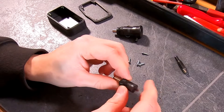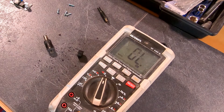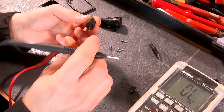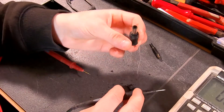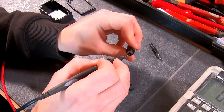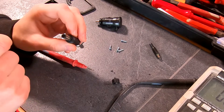Let's figure out which pins correspond to which side of the plug. I'm going to use my multimeter for that. We have this function where I can use the option that it beeps when they connect. Let's first try the ground outside. The pin in the middle is actually not connected to any of the outside points — so the outside sleeve and the inside are different connections.